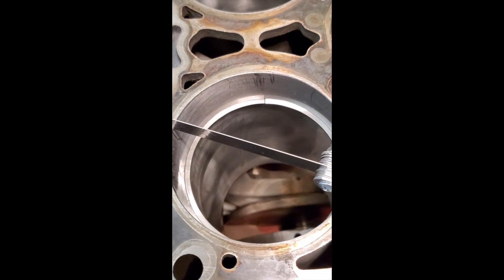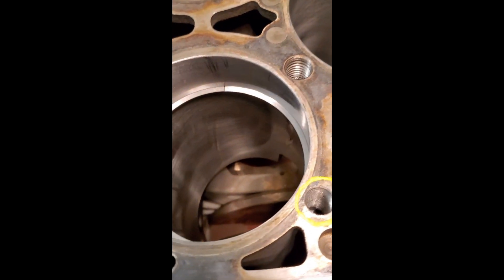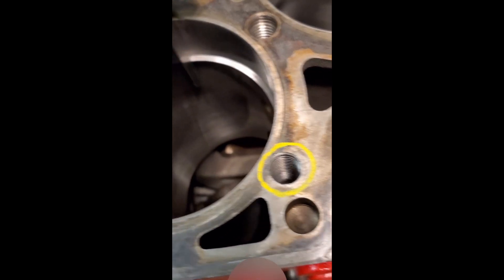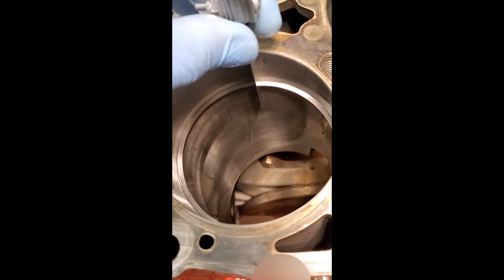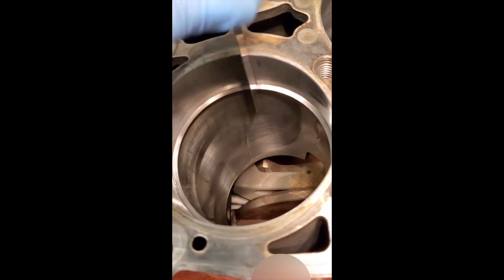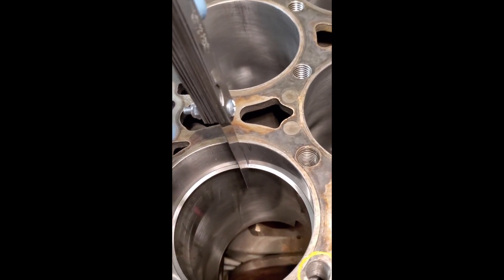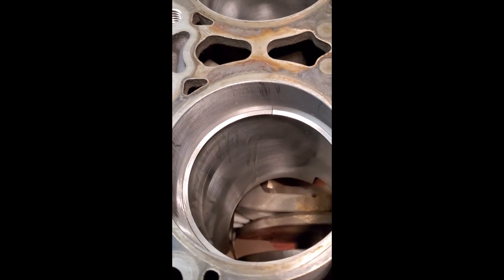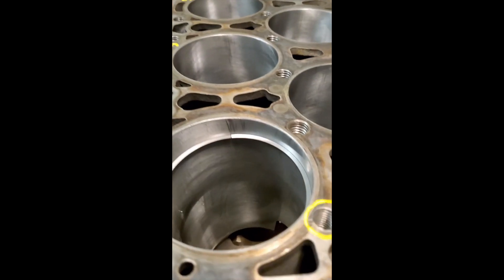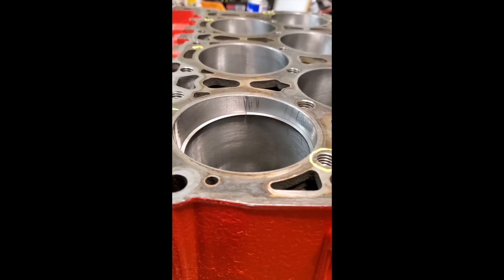Once I'm finished, making some progress, slowly getting there. I'm at 19 thousandths and we've got a nice snug fit into the cylinder, which is nice. We're getting there — a few more thousandths to go and it's snug. I can literally let the gauge go and it stays in there. A few more thousandths and we'll see where it goes. Perfectly lined up and even, as you can see right there. This is great.